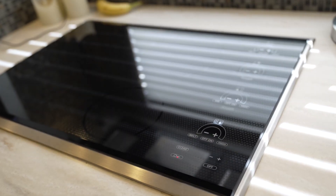The induction cooktop is powered up and ready to go, and I'm now able to run my electric washer and dryer. There are load charts in the back of the Newell manual listing all appliances and how many amps each can draw. Normally bigger appliances run 10 to 15 amps; I just round up and say 15 amps each. With three appliances running, that's 45 of my 60 amps — close to the threshold, so I'd back one or two off if I need to run the dryer.